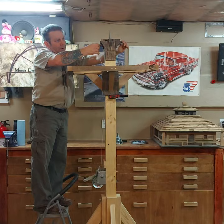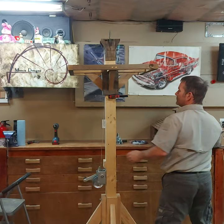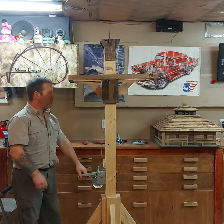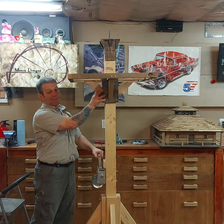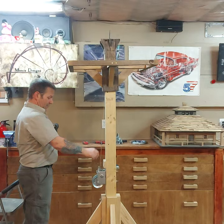This cable goes through, pulls over the top of the pulleys, and hooks right in there. You can see it's now supported by the cable. You can test it if you want at this point — testing might get a little annoying because there's not a lot of weight on it, so it won't come down as easily as you think it should. Once you put the rest of the weight on it, that problem alleviates itself.